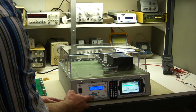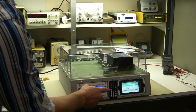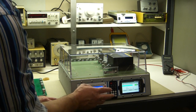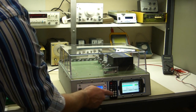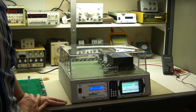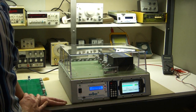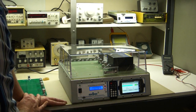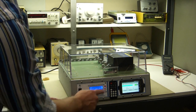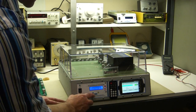That's good if you have bright lights flashing a lot, which will trigger this remote control. What that'll do is it'll cause the keyboard to lock up, because there's no way it's going to give the exact digital data for the remote control to actually do anything, but it will lock up the keyboard. If you have a problem with remote control interference, you'll have to shut this off. I haven't experienced anything. We've got really good filtering. It shouldn't happen.